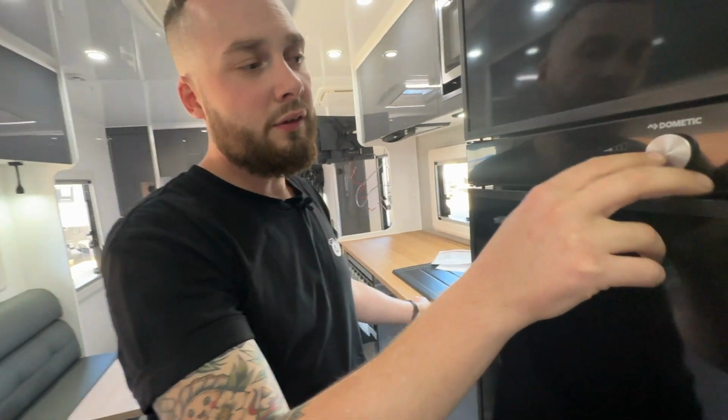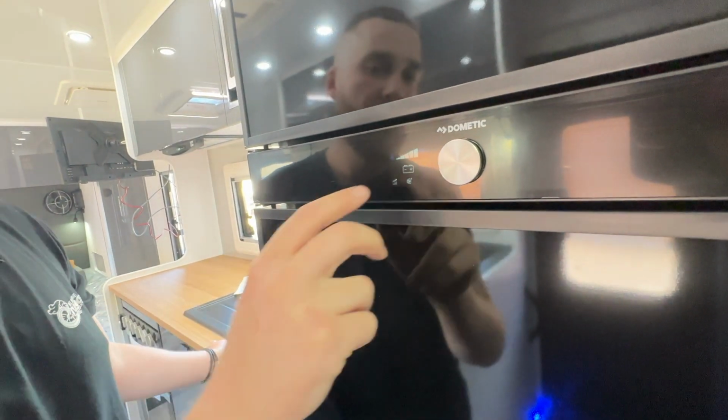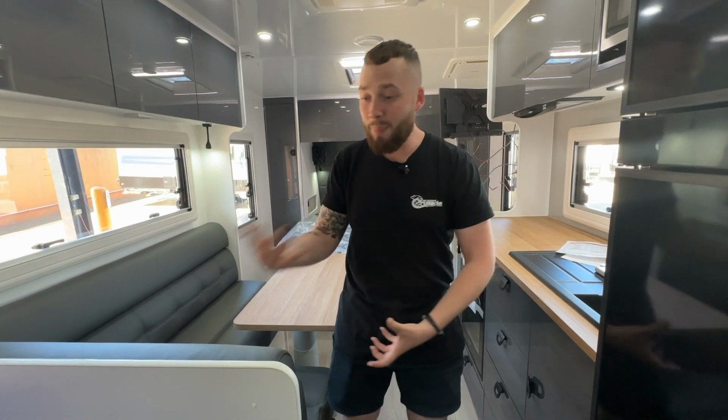If you do this and run it at full capacity, it's going to drink the living heck out of your batteries, especially if it's 40 degrees, because the compressor's going to be going on, off, on, off, on, off. It's got bipolar, it's losing its mind, it's going, what is happening? I can't keep cold, I'm getting warm, I'm back on, I'm off, and you go, I've only been out here 2 days, I've got no power in my system. That's because your fridge is just working overtime.